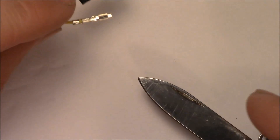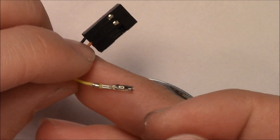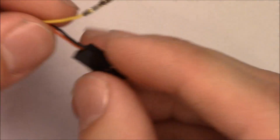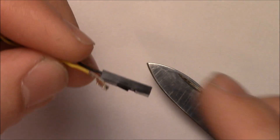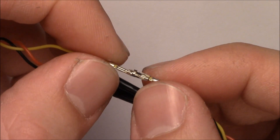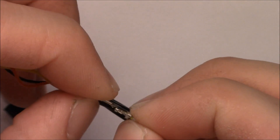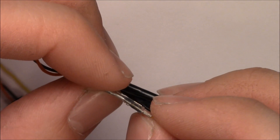There you have the wire. Now you're going to do that to all three wires on each connector — six in total with the other cable. You'll have this little metal connector. What you're going to do is open it up; it has these little prongs. We want to connect them: yellow to yellow, black to black, and red to red. Then basically mash the connectors together by opening the little tabs on one and inserting the other, then use some pliers to crimp them together for a good connection. They need to not be wiggling and need to have good metal-to-metal contact.